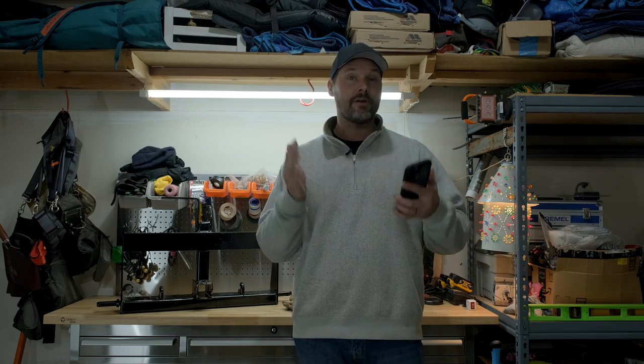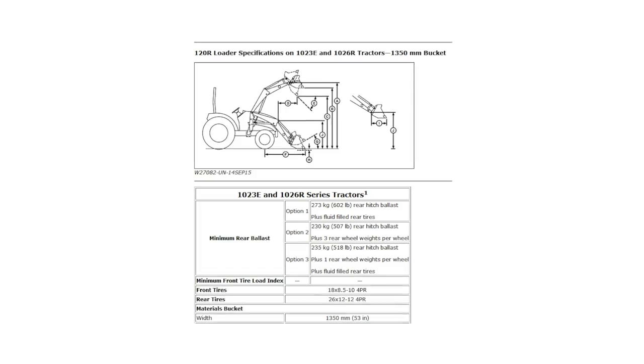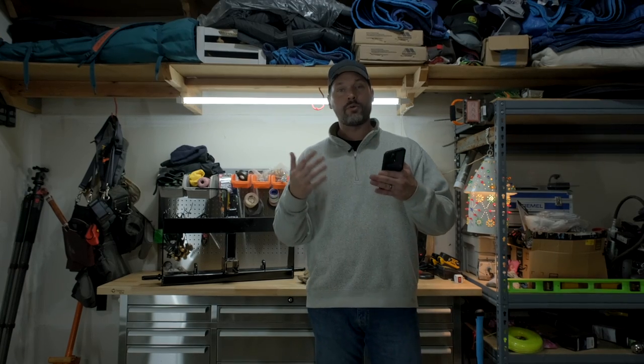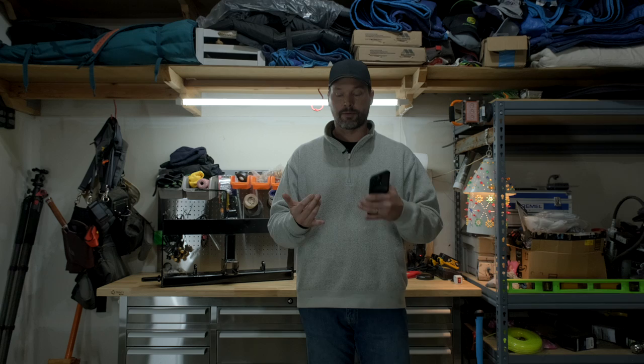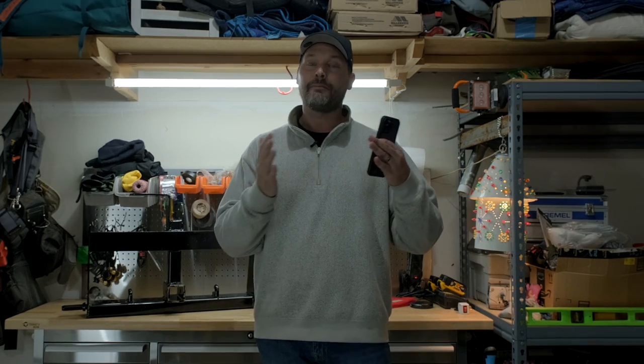John Deere is very good about putting ballast weight requirements in their manuals. If you look in a loader manual, it's going to tell you exactly what your minimum ballast weight requirements are. And even if you don't have a John Deere tractor — say you have a Kubota, an LS, Mahindra, whatever it is — find something similar in the John Deere world and reference those manuals online to get an idea of your minimum ballast weight requirement. Typically that will include multiple forms of ballast weight: something on the wheels, something inside the tires, and something on the three-point hitch.